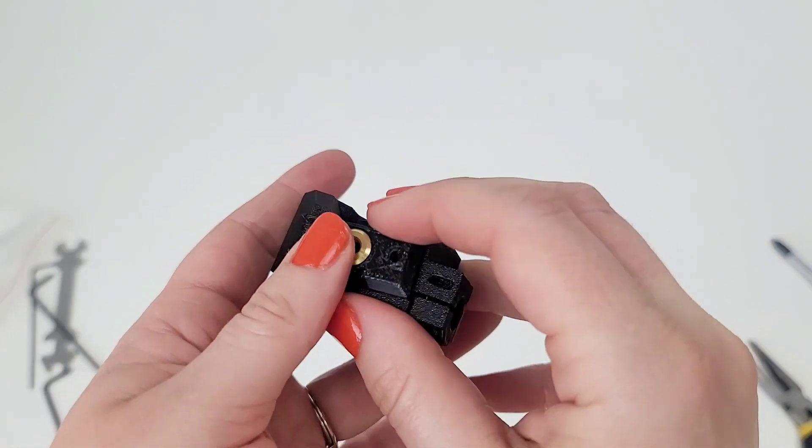Now we want the super FINDA sensor — for me that's the last thing in the big bag. Then an M3 by 10 screw and an M3NS square nut. Step 10: insert the M3NS nut into the marked opening on the front of the selector. We have it facing this way and we're going to put it in here — that one does not want to go in easily. Okay, that looks good.